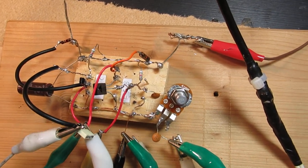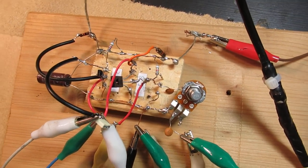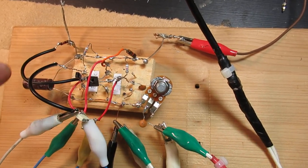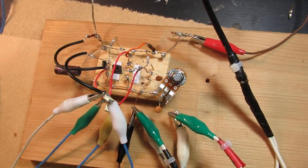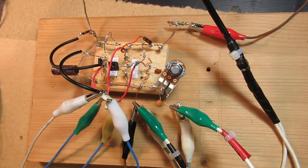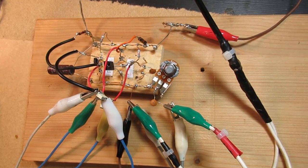though, of course, the waveform is perhaps not always what you like anyway. It's a function generator now. That's the aim of this video. Very, very easy to make two transistor function generator that can work between approximately 70 Hertz and, say, into the 20 kilohertz range.